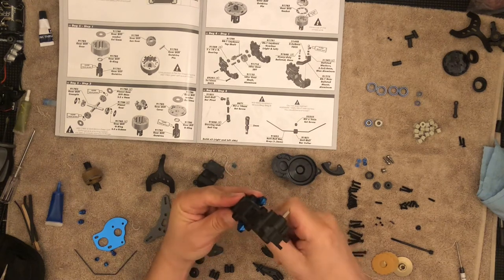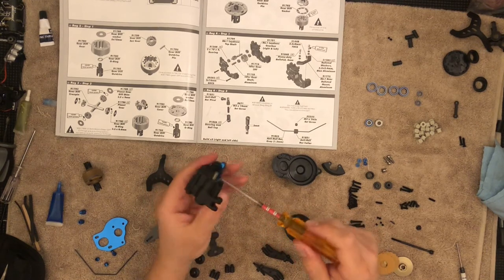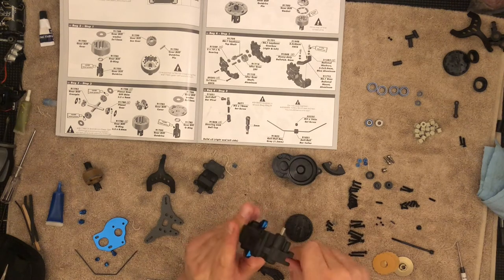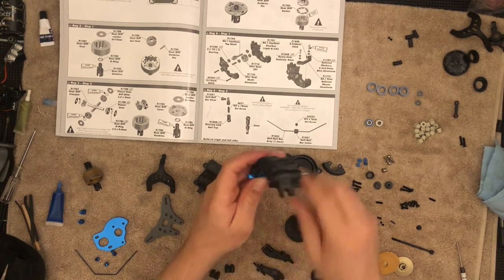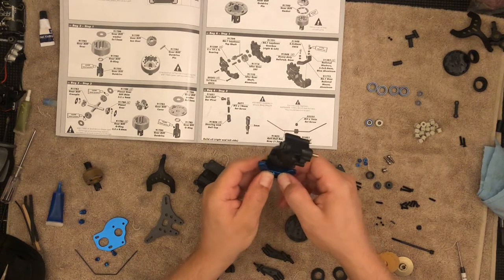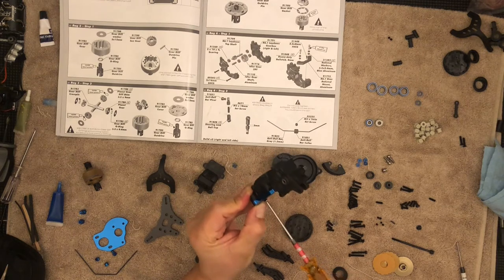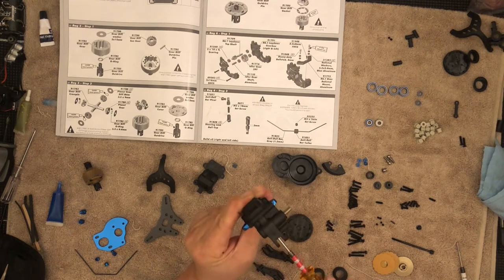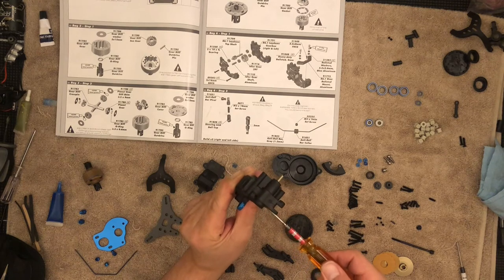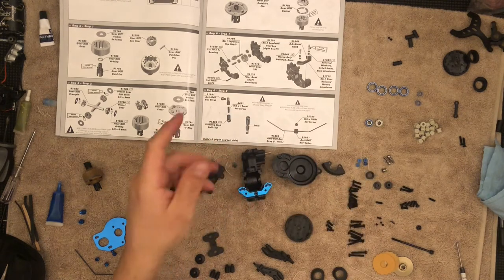Not working — back it out, I don't think this sat properly. There we go — you just need to make sure this thing seats properly. Drive it in, and as soon as you feel some resistance, go ahead and stop, because that screw is going right between the two halves. All right, now we have that.